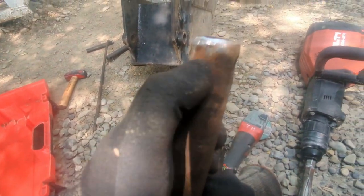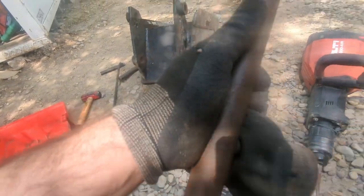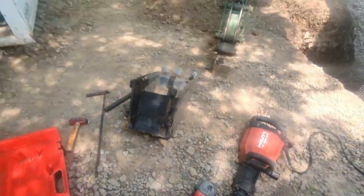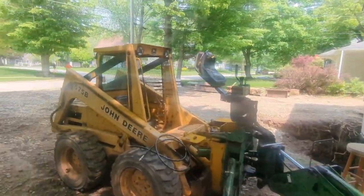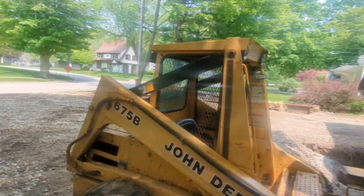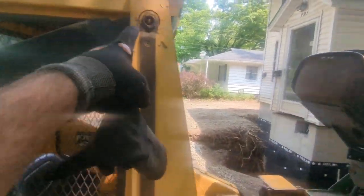And in this case, dry over here, this should be slimy with grease. And at some point, I mean, that's how I was raised. Before you go out with the rakes or the tedder or any of the farm equipment, you grease it. When Sean was here, all of his grease fittings had fresh grease on them. I saw him run the grease gun at least once onto everything. You just get into the habit of it.